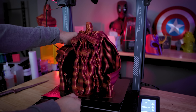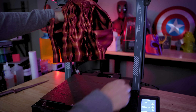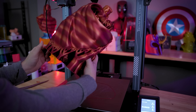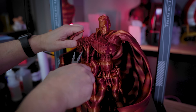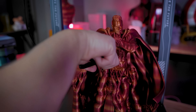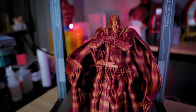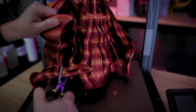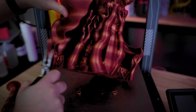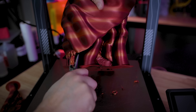One additional thing to mention: since you are going to be printing with a larger nozzle size, when it comes to supports, you are going to be printing some beefier, tougher-to-remove supports in some cases. These prints here were a little difficult getting some of the supports to pop off. So you might want to further refine and test some of these settings before running off some really large prints. Overall it wasn't too bad removing them, though I did end up breaking the sword on this little miniature of myself and had to 3D Gloop it back together.